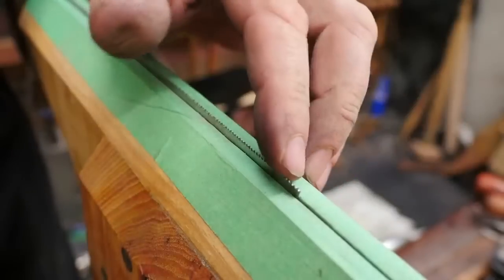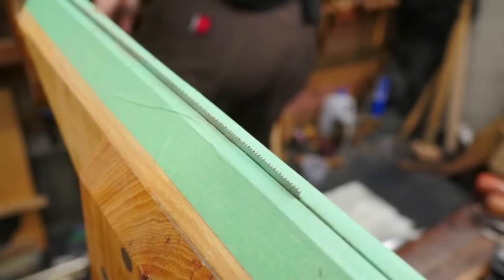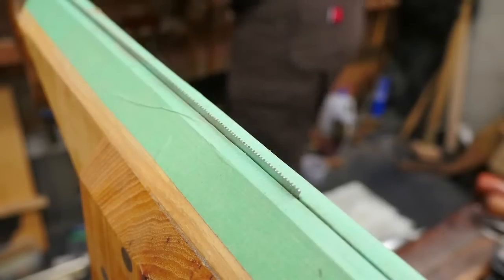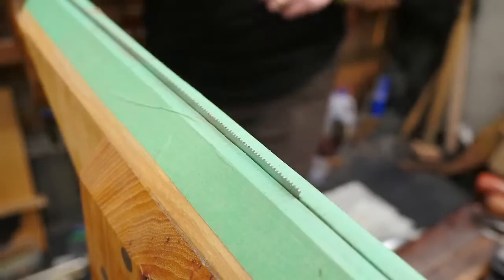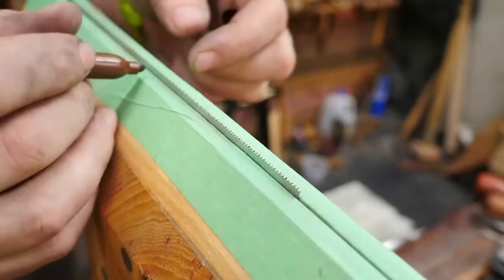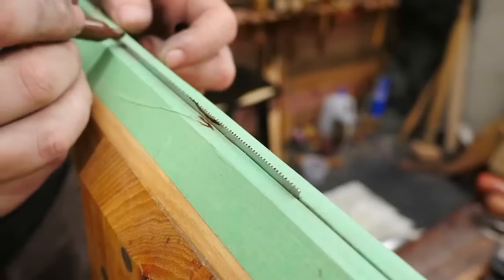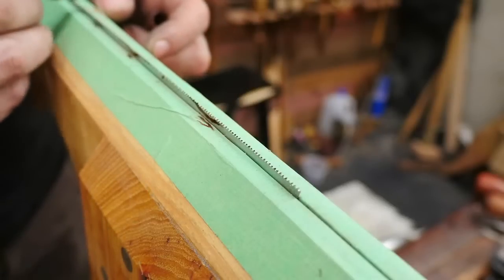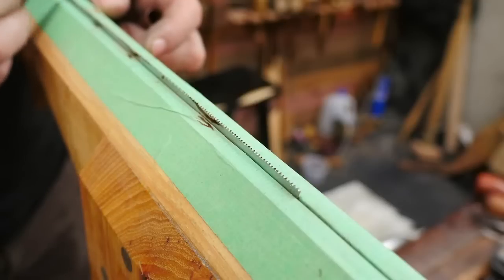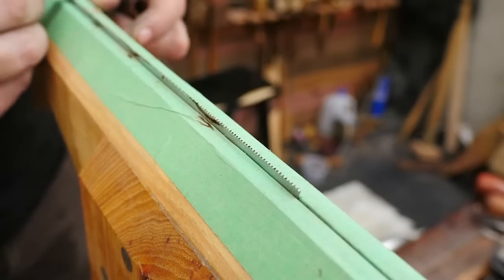And these ones are going to get hard to see. So I'm going to pull out another trick, which is to hide the tool I'm looking for. I need a Sharpie. Where did my Sharpie go? Is it out on the counter? Yeah, it is. It's out on the bench. So I can put this on here. I'm actually going to saw the tip off of this, basically. I'm going to hit all the teeth with the Sharpie. And when that little bit of dark spot disappears, I've done that tooth.